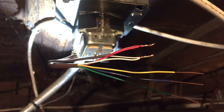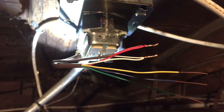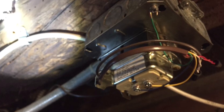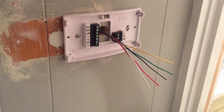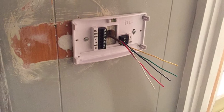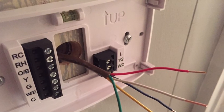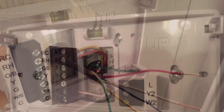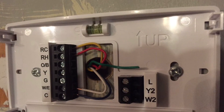The red and white wires I wired exactly as they were before — red being 24 volts coming from the original transformer, white being switched when the thermostat calls for heat. To wire the new transformer, I used blue for the common terminal and yellow for the load terminal. At the thermostat, I wired red to the RH terminal, white to the W/E terminal, blue to the C (common) terminal, and yellow to the RC terminal.